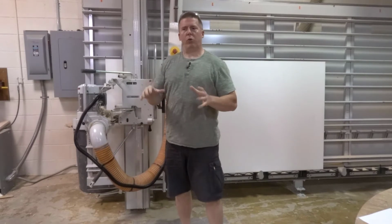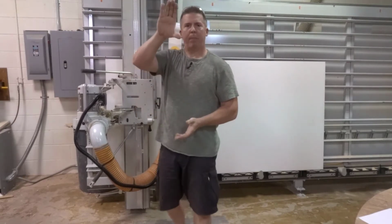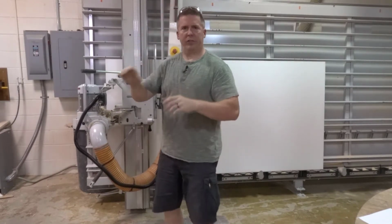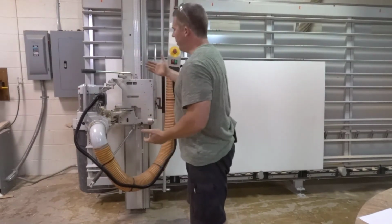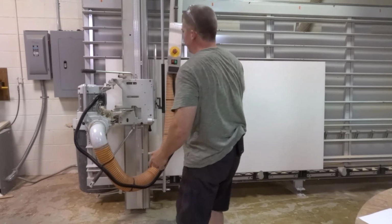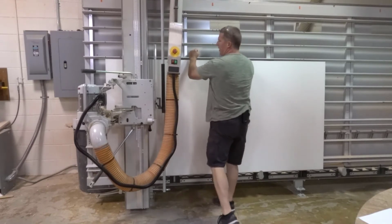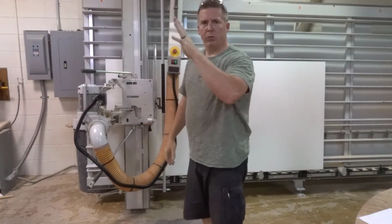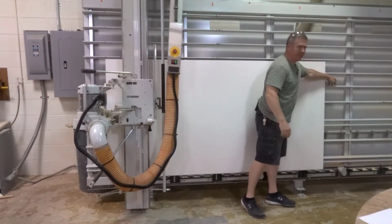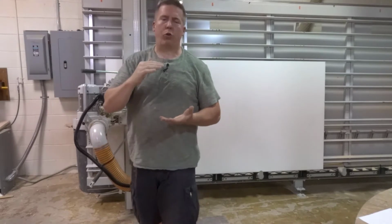But the thing I want to let you know ahead of time is, after we make the cut across to the other side, the top piece and the bottom piece are going to have an 1/8 inch gap. That's where the blade is cutting. And those are going to want to collapse once I come out the end and pinch the blade. That's going to cause a bad burn and a lot of tear out, and it just doesn't make for a good piece. So at the end of the cut, if there are other people in your group working, have them stand here after you go by to lift that piece off. If you're alone like I am, I'm going to use my left hand and put it right here as the saw is coming out. I'm going to lift it off of this little flap, lift it up so that will keep them separated so that they don't crush the end.